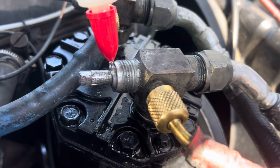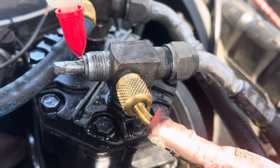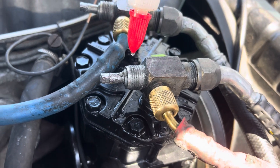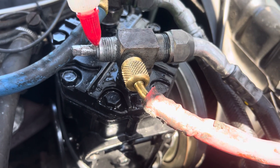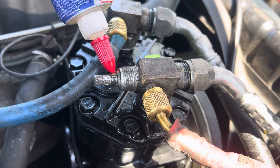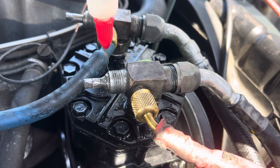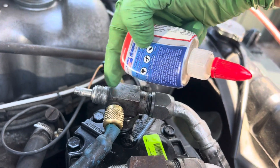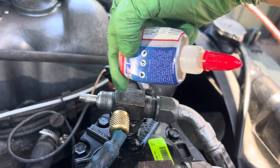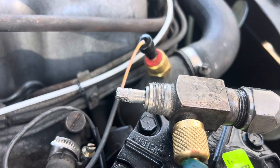So here's what I'm showing you — see this little shaft in here? There's a packing in here, and if you ever find that you can't pull a good vacuum, it's because of this packing. Let me get that around — it can leak vacuum through this packing. You have to screw these halfway in, halfway out, or just crack them a little bit. Let me see if I can zero in on this for you.